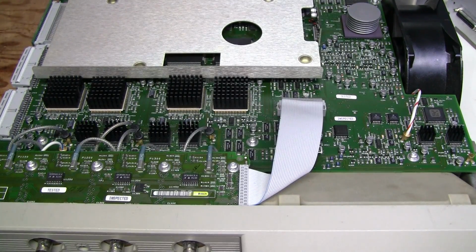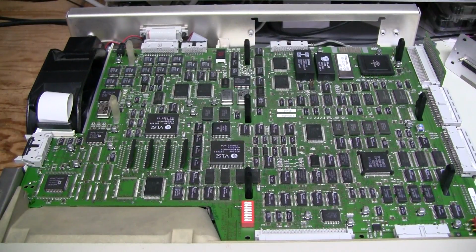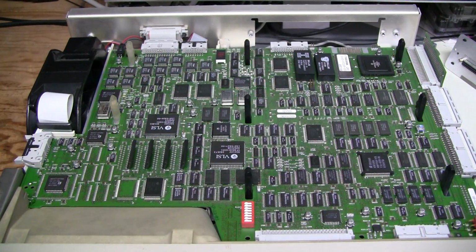After fixing these two problems, I never saw self-test failures and waveforms were stable. So I started checking the CPU board. I spent quite some time checking it, testing the traces and vias around the capacitors, randomly checking different data buses. I used the working oscilloscope to look at the waveforms on the memory chips and such. I couldn't find anything wrong.